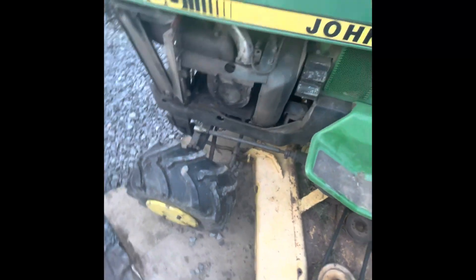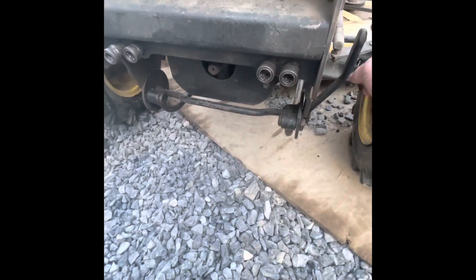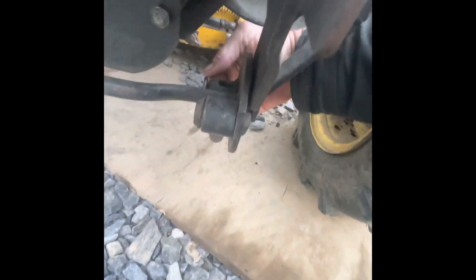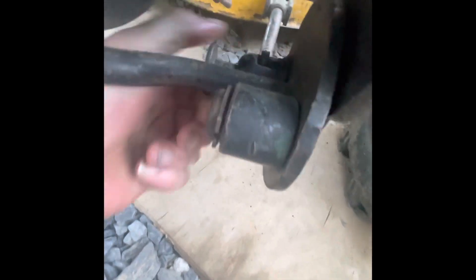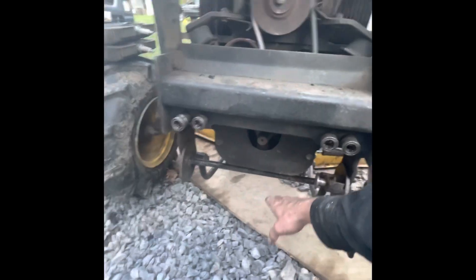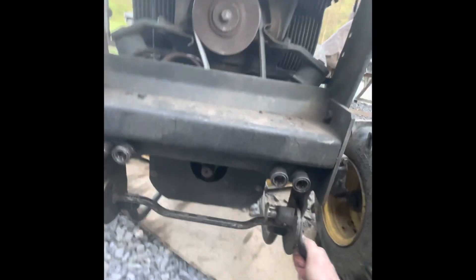In the front, a lot of the 400 series have this quick disconnect. Under here there is a lift spring with a lock pin — pull it out, change hands, pull it out and lock it into place so it stays out. Pull this handle down and it will allow you to spin this handle down and drop the front of the mower down.